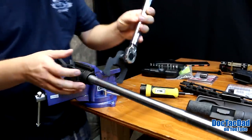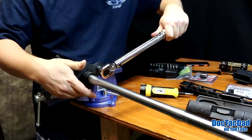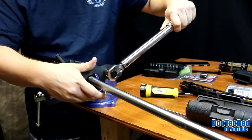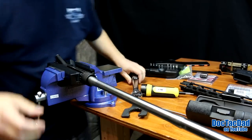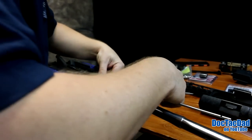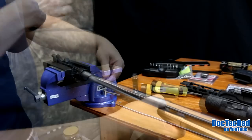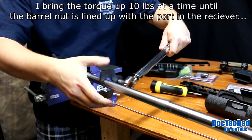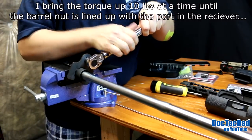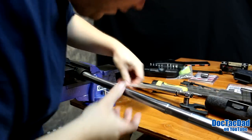So I have my torque wrench set to 30 foot-pounds of torque. We're going to line up the nut and torque it down to 30 pounds. Okay, there's 30 pounds of torque. Now we're going to take the gas tube and check to see if the port lines up — and it doesn't. It looks like we're almost three-quarters of a lug off. So we're going to go up to 50 now and see how well that works. There's 50. Check our alignment now — we are still way off.